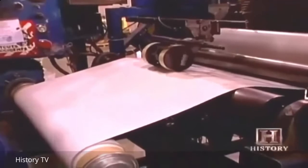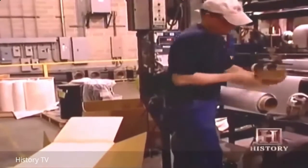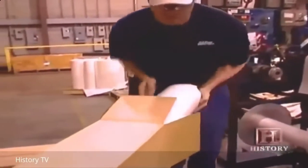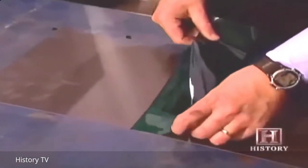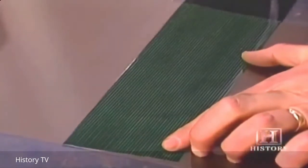But before FlexMag ships the rolls to its clients who apply those touches, how can it be sure of its product's stick-to-itiveness? One of the ways we make sure that the magnetic material is actually magnetized is we use sheet vellum. The vellum is actually two thin pieces of plastic with a liquid medium in between that holds fine magnetic particles that align with the magnetic pattern. This material will show you the magnetic imprint on the magnetic sheet — the same magnetic imprint that was used on the rare earth magnet roller.